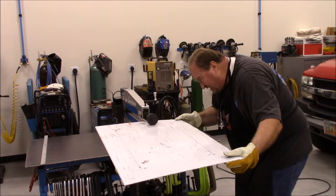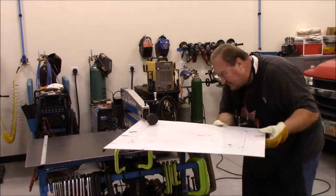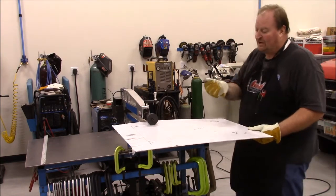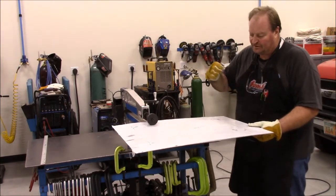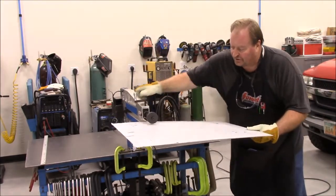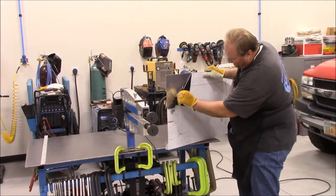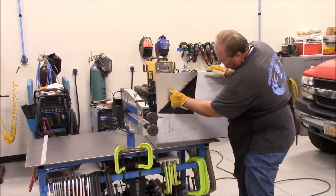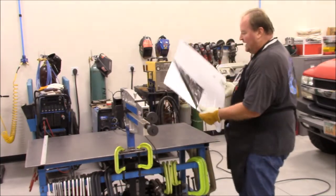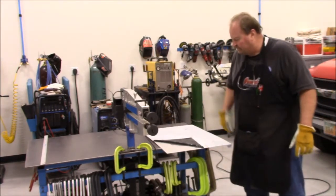The trick on these is to not stop on the turns — you want to make it in one fluid motion. You don't want to stop and tug and pull or you'll get little jagged edges on your turns. By keeping the wheel moving and turning it, you'll get that nice smooth constant radius. I'll set this one on and see how she looks and start pop riveting it.